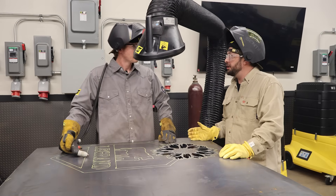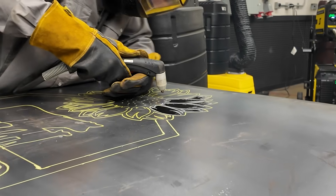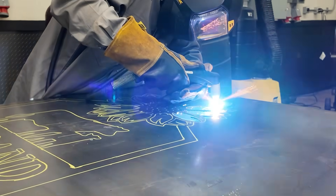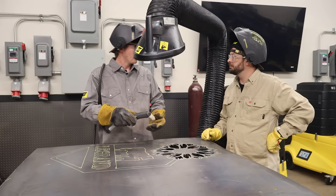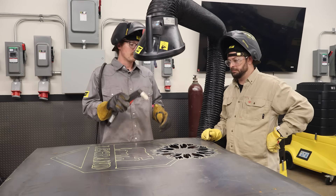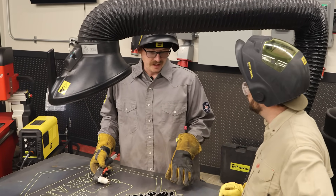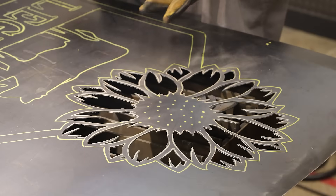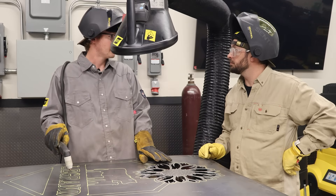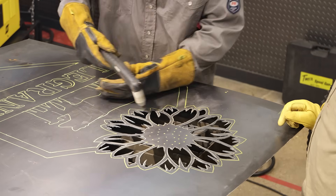Let's talk about travel speed — how important is it to maintain a consistent travel speed? We're running hot, so we don't want to go too slow. The kerf width — the distance from one side of the arc to the other — is much wider at higher amperage. So as you're cutting through, you're going to end up cutting more of what you want to keep. We're running really quick. With artistic work, I'm not too concerned about staying exactly on the lines because I know what I want the shape to look like, but on letters I really like to stick to my lines for nice straight results.